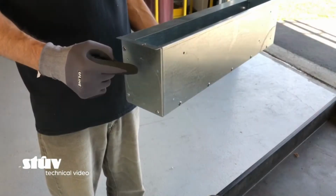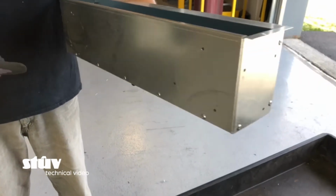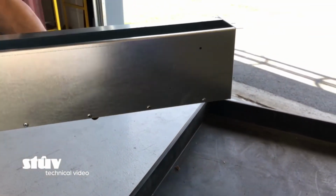To connect the air conduit to the airtight box, there are 4 options to choose from, as you can see here. Simply knock out the plate for the one you wish to use and hook up the air conduit. The knockouts are 4 inches in diameter, so you'll need to reduce your conduit if it's bigger than 4 inches. In the case of the double face models, simply connect the air conduit to one airtight box and then run another conduit to the second box. These airtight boxes ensure a positive connection and allow exterior air to flow directly into the fireplace.